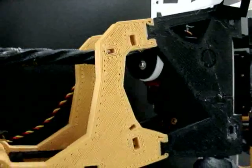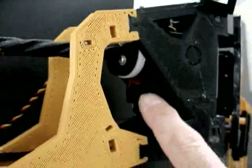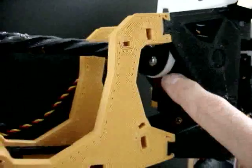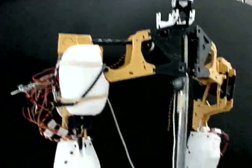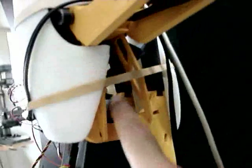I've also ordered some modified encoders — magnetic encoders that are going to be set in the servos so the rotation can go over more than zero to 180 degrees. So like this it can turn and pull the whole system at once. There's pretty much the same mechanism in the biceps — when it's pulling, there's a thread inside. It's a real mess at the moment because it's all attached with temporary stuff.